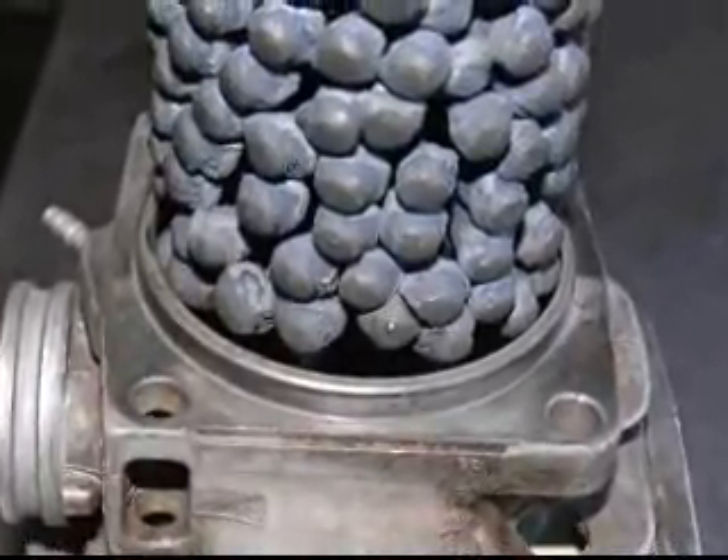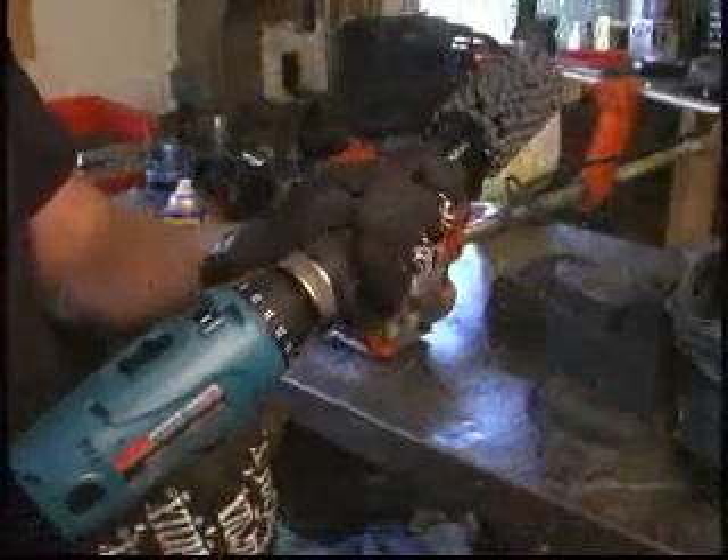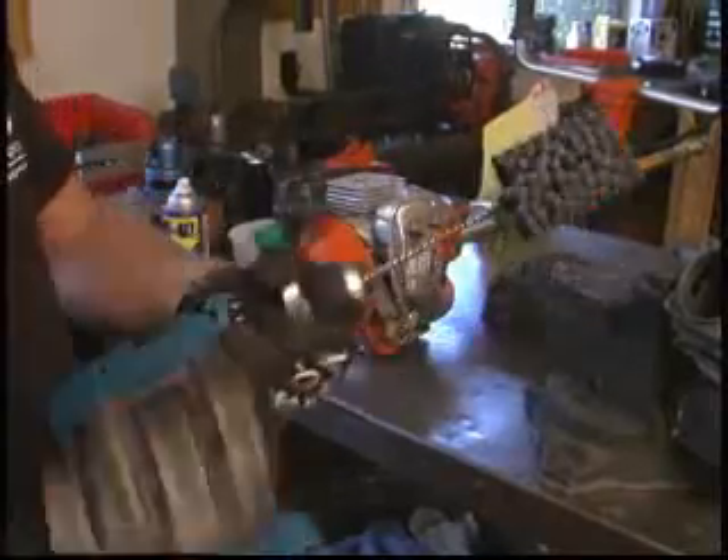The degree of oversizing creates a soft cutting action and a nice deburring of the cylinder ports. We recommend attaching the Flex Hone to a portable or cordless drill with a three-eighths or half-inch chuck.